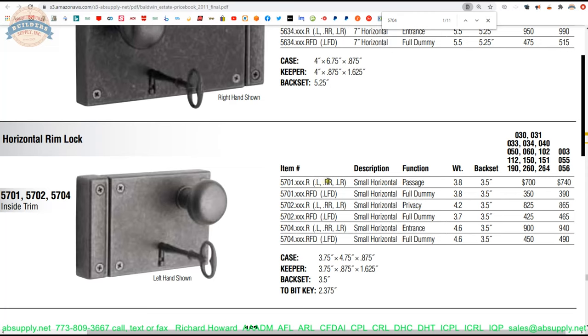Their handing chart shows: the active door here is left hand; this would be a right hand. The trick is: on the active you might have a left hand reverse, but on the dummy they don't offer LR or RR — you just order an L or an R. A dummy trim rim lock must be used on all pairs of reverse-bevel doors. If you have a pair of doors, you mount that lock body on one door and the strike is going to be like this — you'll need the dummy mounted on the other door for the latch to connect into.